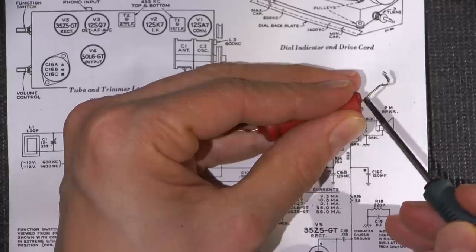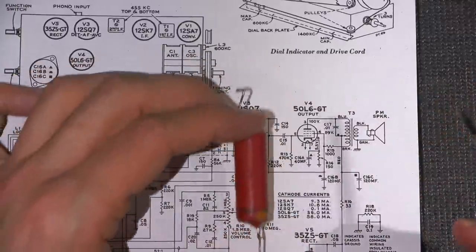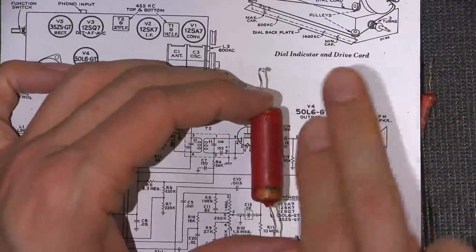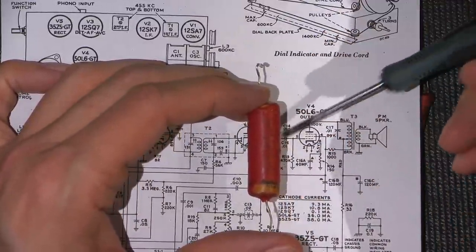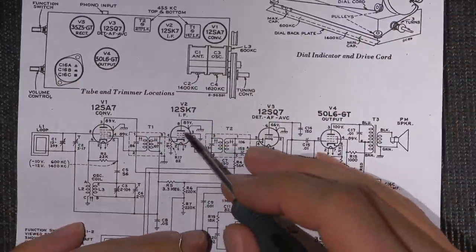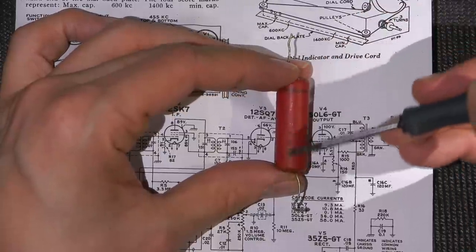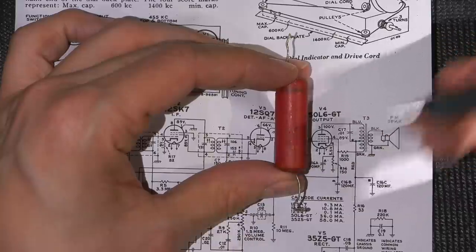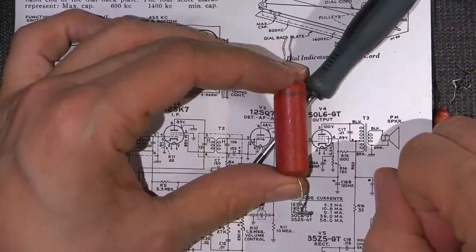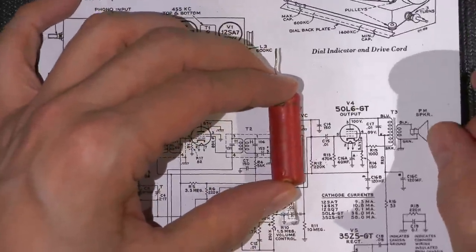Now, in high frequency circuits and RF circuits and things like that, it is very important to make sure that you have this orientated the right way. And in screen grid bypass applications where you, say, have a filament line or this is connected to a very sensitive element, having twisted filament leads running even parallel to this or underneath it a lot of the times isn't good enough if these are installed the incorrect way. So if this was installed to the screen grid of a vacuum tube in an amplifier stage or something like that, this way, this whole area of the capacitor is attached to the screen grid. And then this would just be attached to ground here. So if there's filament lines running underneath it like this, you can see what would happen. A lot of the times you'll get a mixing effect and you'll get a hum in your circuit. Again, countless hours of experimentation, and yes, it does happen.